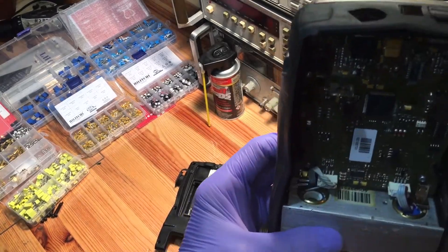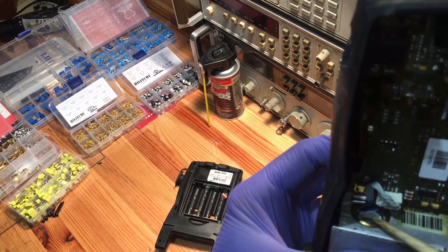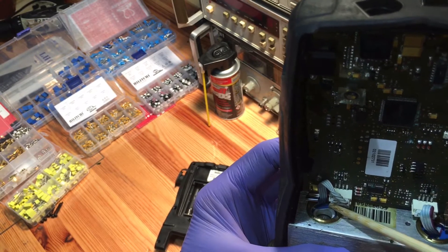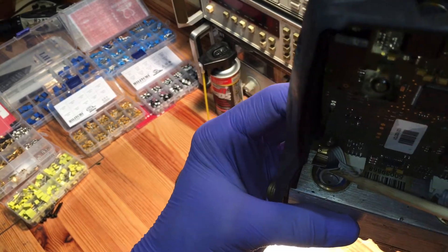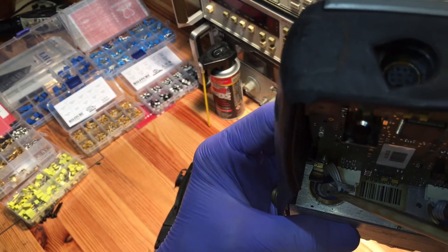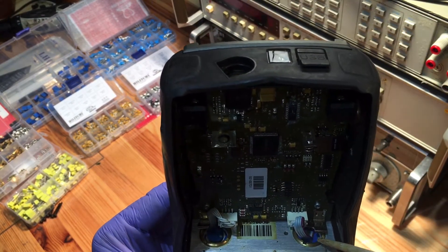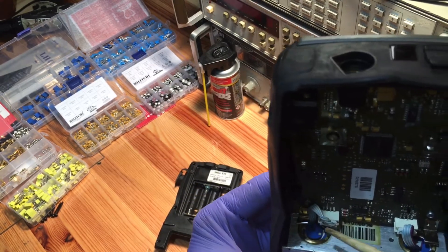When I went to a thousand, I believe these are the safety pop-off. This is the transducer — you have a low and a high side transducer. If you see this little flap right here, it's not supposed to be like that, and there's a little tiny hole in that transducer. I believe that's their overpressure blow-off hole. These were sealed down with an epoxy coating, and you could possibly see that bluish coating. This one is down — this one didn't blow out, but I believe this one did.